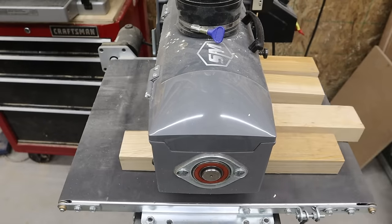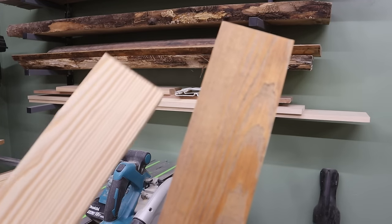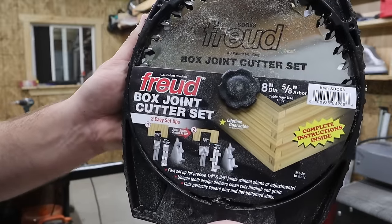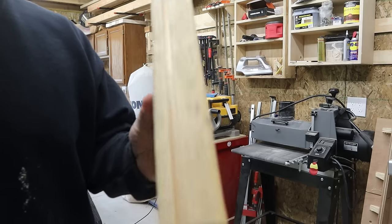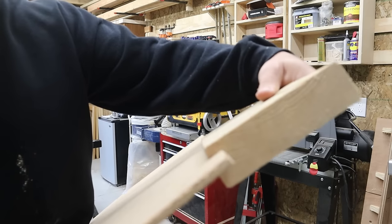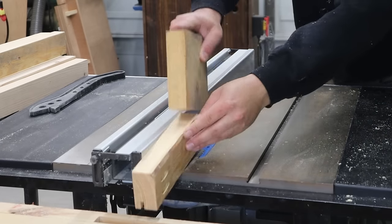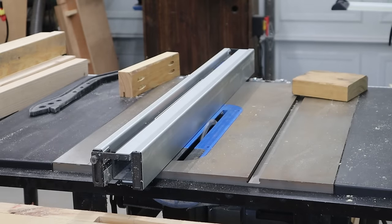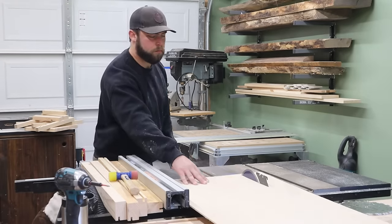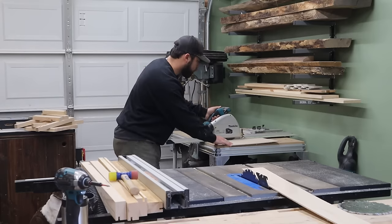You can see what a difference an unsanded one looks like versus a sanded one, and I'm glad I took the extra five minutes to do that. I ended up getting this new box joint blade, which is pretty cool the way the teeth alternate. I was able to make a perfectly quarter-inch groove in the pieces, and then a quarter-inch panel fits nice and loose in there. I just made sure to line up all the faces on the table saw fence and cut those grooves. This is where the MFT table or track saw really shines — I can rip the plywood on the table saw and then immediately cross-cut it with the track saw without going between two different setups.